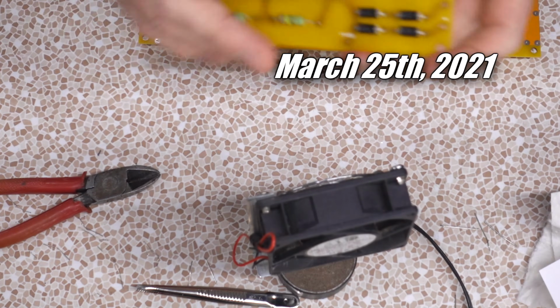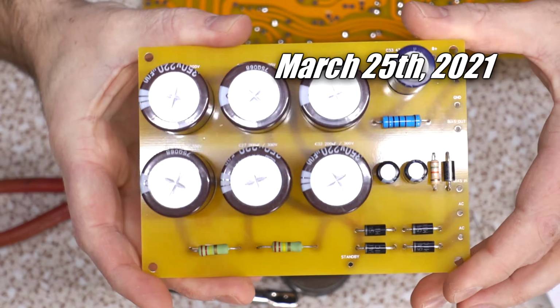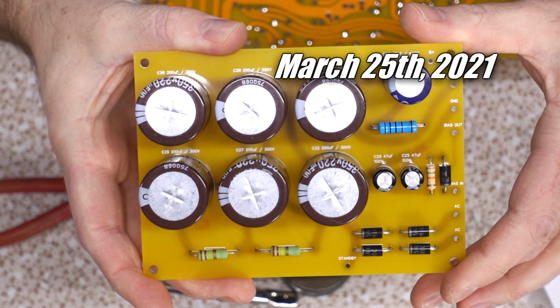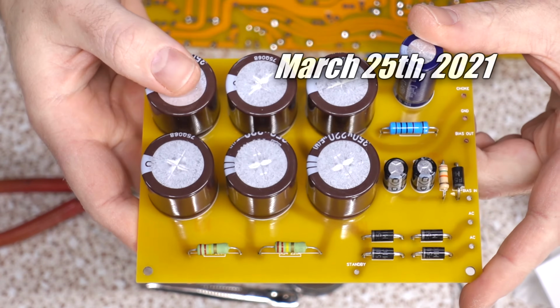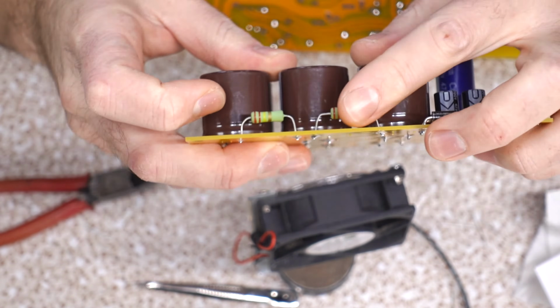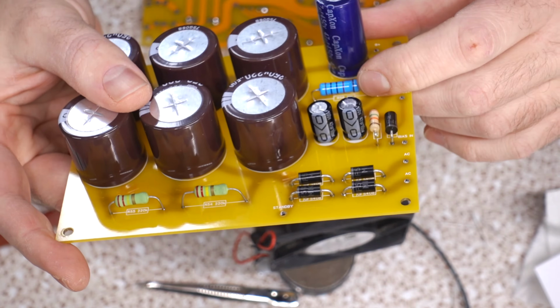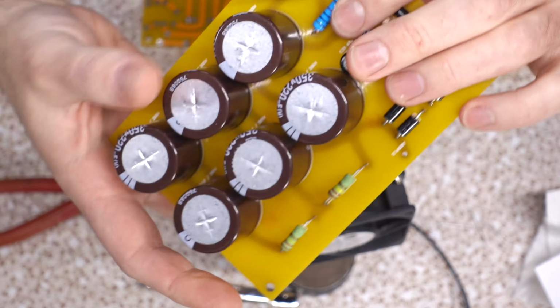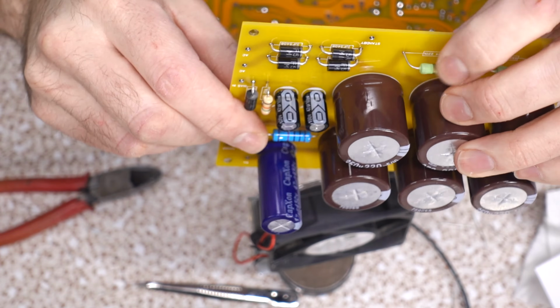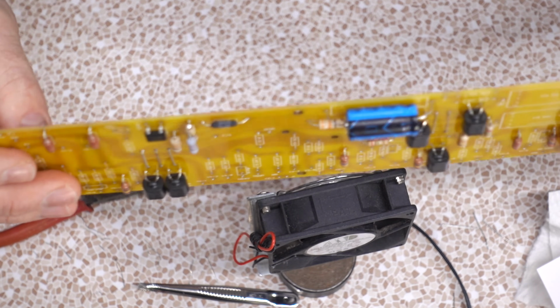So I've started doing the soldering of the main boards, and it's a pretty simple process. Pretty much just connect the dots. Seen here, the power supply board's done. And if there's a component like resistors that I think are going to generate heat, I float them a bit. It looks nice, and well, it's going to give them room to breathe. In a lot of these cases, like this 10K, that's definitely going to put out a little bit of heat. So small victory. On the main board, we got a couple things going on here.